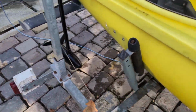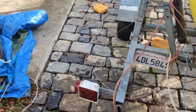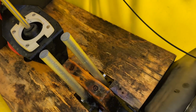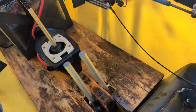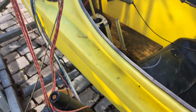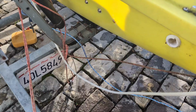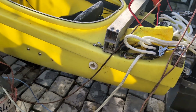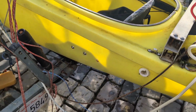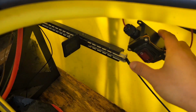The battery also powers a small bilge pump. The bilge pump is under the floorboards here. Underneath the floorboards, there's a 3/4 inch pipe that diverts water from the bottom of the boat to the back. You can see it coming out here. And because this is frequently underwater, especially if you are pitched up, there needs to be a series of check valves inside, or else the water will flow backwards through the bilge.